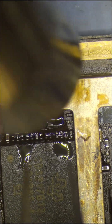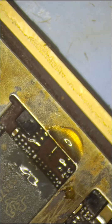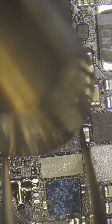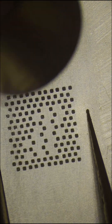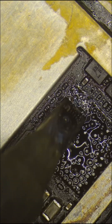When it didn't work after replacing the CD3217, I was quite disappointed. It turns out it's one of the things Apple has decided to do with their newer devices — all devices that take the CD3217 B13 and above are paired with a ROM chip that is required for the board to function. So even if you replace the chip with a perfectly working CD3217, the device refuses to work. It recognizes the charger is plugged in but won't actually charge. To fix this device, I had to harvest a working CD3217 and its ROM chip from an iCloud locked donor board, then reball the chip and transfer it over to our device that doesn't charge.